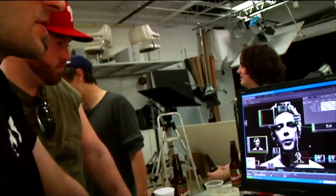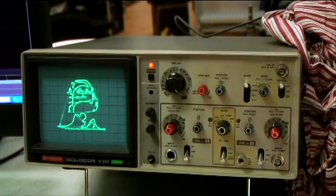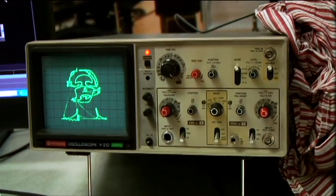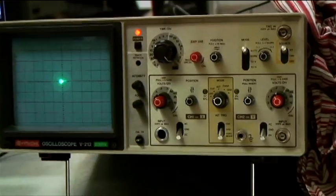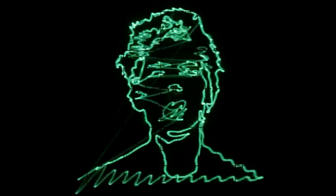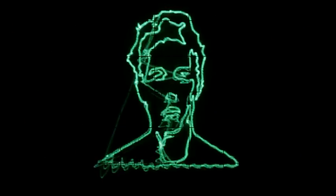We're looking to do a video and Jared had a good treatment that we really liked. It's all shot and then it's going to be transferred into a machine called an oscilloscope. Basically the scope is set up so that the left channel controls the horizontal movement of the dot and the right channel controls the vertical movement. So you can see the scope is just a single dot — it's like a very fast Etch A Sketch tracing out a single line. If you give it the right signal, you can pretty much reproduce whatever you like.